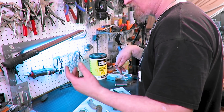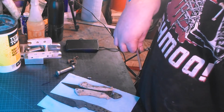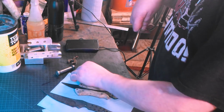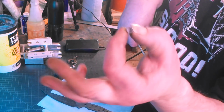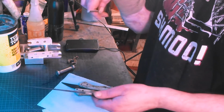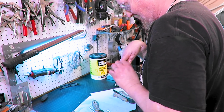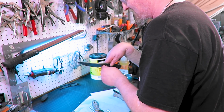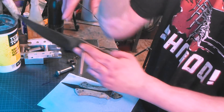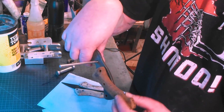Now Chip is one of my subscribers, been for a while, and I was trying to tell him about making pins. If you don't want to buy pivots like this, that are already made for knives, you know, pivots that have 8/32 threads and all that, what you can do is if you find something tight enough, you can take this, put it in here, and cut your pins like this, and make your own pins. See how tight that is? And now you'd want to cut this side just small enough, and then you'd have it for there, and that would hold it together.